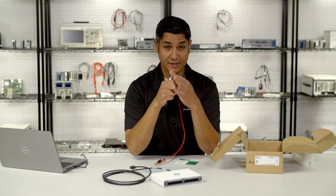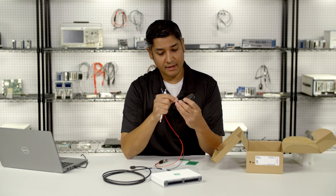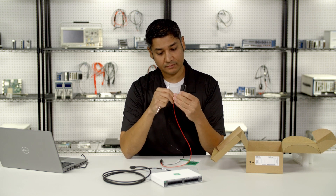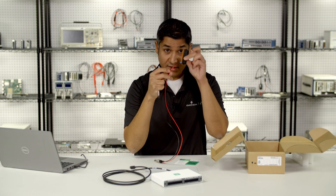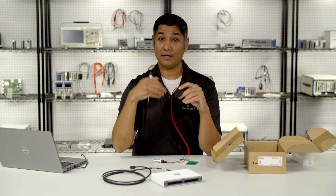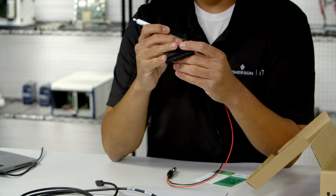Here I've got my wires for my signal connection. I'm just going to go ahead and connect into channel zero with differential signaling. And once I've inserted it, it's pretty easy, and I get a very secure connection. Now to remove that connection, that's when I would use the screwdriver.